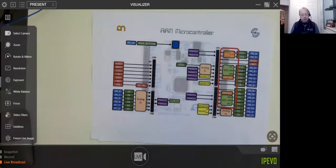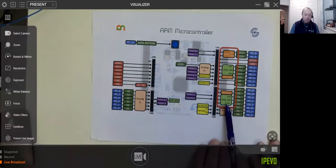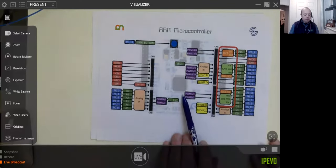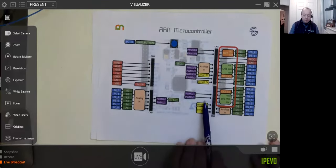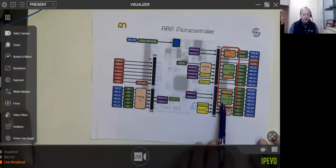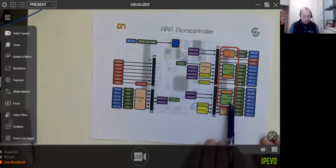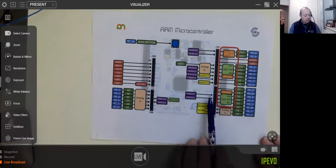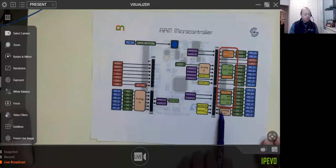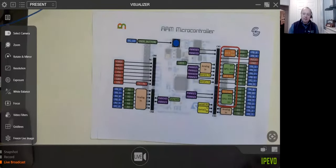If you move over to using ARM chips, you generally find, even on the most basic chips, and this one here is probably the M0 Nucleo board, I think the 072, if memory serves me correctly, that you'll get several I2C ports and SPI. Here they've got a couple on here, and you generally find that some of these other pins, which are sort of grayed out here, are other I2C ports and SPI ports. So which one do you go for? I don't really think it matters that much. Whatever you can buy, I suppose, and whatever you're comfortable with in terms of plugging things in.